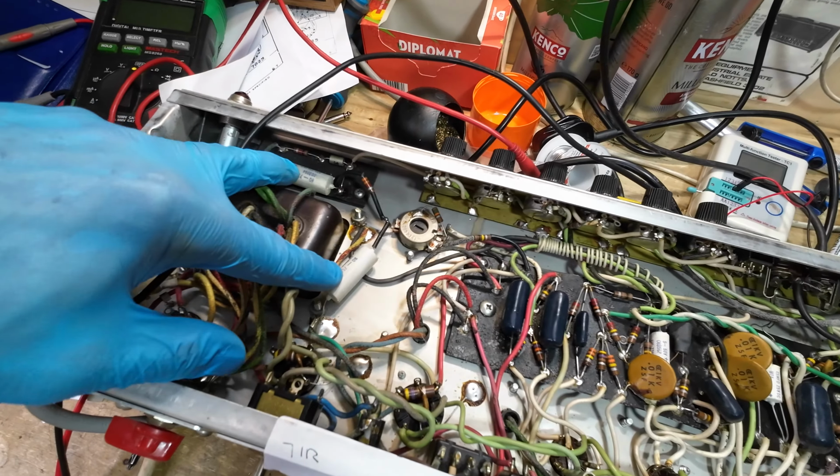Right, we've changed that fuse and I've added that 13 amp to my ever-growing collection, and the drawer is labelled Chocolate Fire Guard. Right, we'll fire it up and see what we've got. So we've got a 40 watt bulb on the current limiter at the minute. Go, and that's glowing quite brightly at the moment, so we'll wait and see what happens.